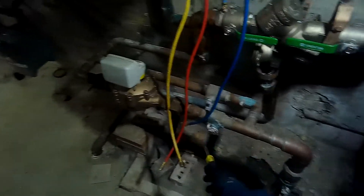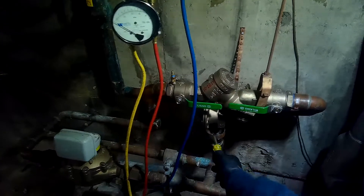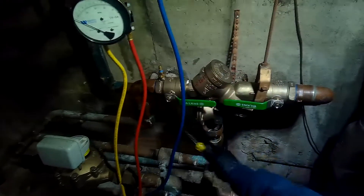We've got some issues here with valves and leaks, but our incoming water goes across here. We have a bypass to bypass the meter to ensure we still have water flow to the building. The flow is coming this way, through check valve number one, check valve number two, and continuing on to the building water supply. We also have a secondary backflow preventer - a double check valve for an irrigation system.